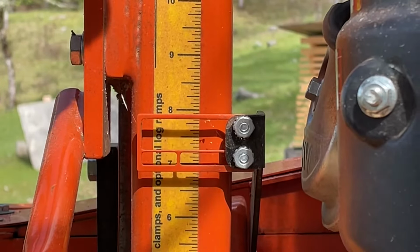On the first cut, a lot of times I do each board individually. That way I can custom cut them to get the most out of each one. I probably lose some time by doing that, but I gain more wood. And a lot of times I'll end up with more 1x6s that way instead of 1x4s, or I'll end up with pieces without wane instead of pieces with wane.